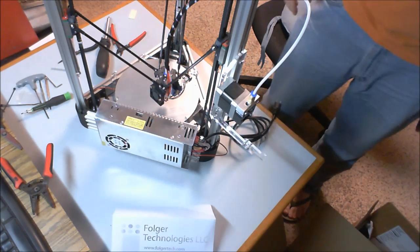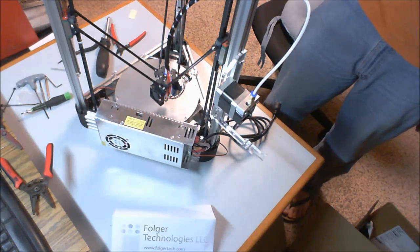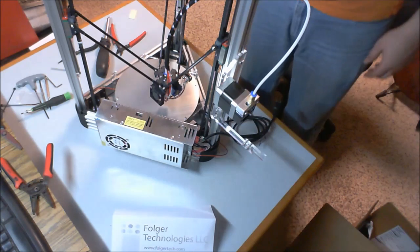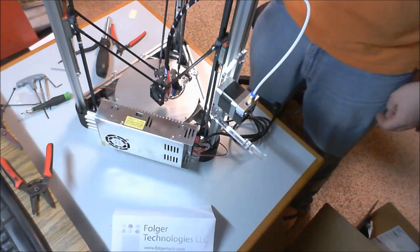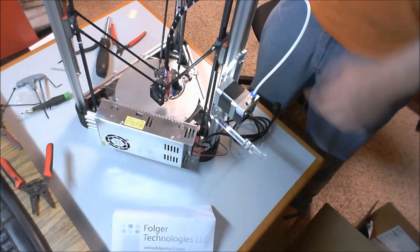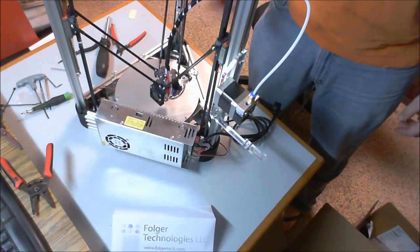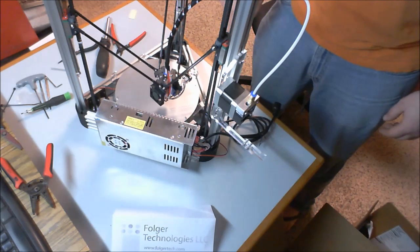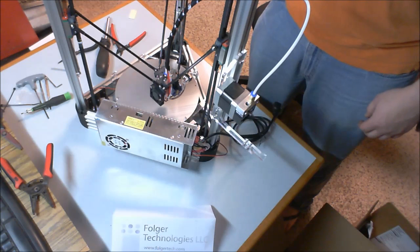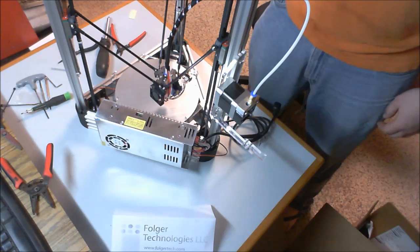The next step is to dress your cable. Now I've already started on that. You are given some loom material or cable wrap. This black stuff here. Use it. I would say start with your hot end and the cables that are running to it. Get that all organized correctly, and then see what you have left. And do your servos, or excuse me, not servos, your limit switches.